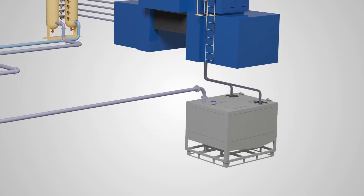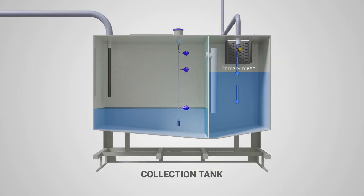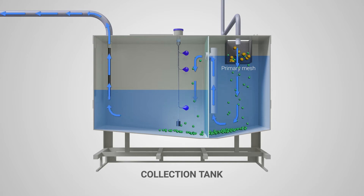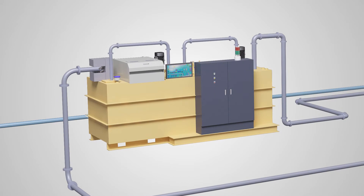Two: the collected material is moved by a submerged motor into the main release agent supply system. The release agent is then moved from the main system to the primary tank — the release agent recycling supply tank — and filtered by a paper filter for fine residues, and then by a belt skimmer for oil.